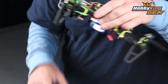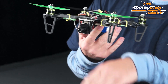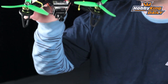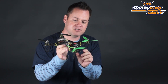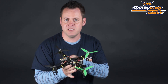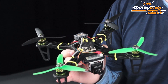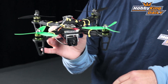Now on the front, like I was saying, it has a little pan and tilt. On this one, since I was using it for racing and testing, we only have the tilt on it. You don't want full tilt where it's completely level because you lose the sense of climbing up and down. So I just let this, when it's at full bank angle, instead of looking at the ground, I let it just pitch up a little bit so I can still get a sense of the ground but still realize that I'm dropping. That's linked to the multi-Wii I have in this — the multi-Wii Mini — so it's got full barometer and compass on it. You'll also notice a Bluetooth module, so I've got full telemetry on this one as well, so when I'm racing I can go back and take a look at my specs or PIDs or whatever I need.